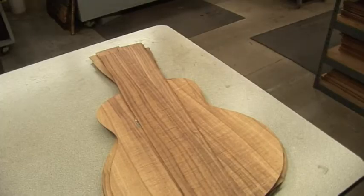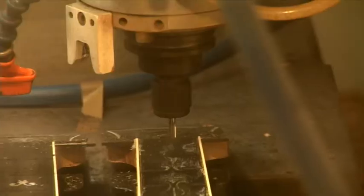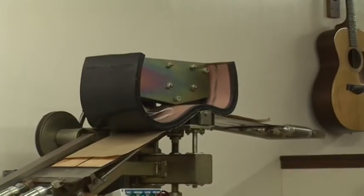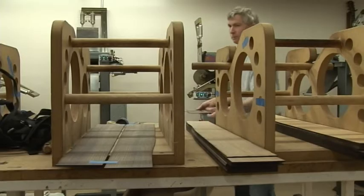The panels are cut to shape. We're using lasers to cut wood out. We're using computer-controlled machines to do intricate work. A guitar body is made of a top and a back and a set of sides. The sides are bent on benders and eventually they're put together with blocks, and they have a lining that's put on them that makes a little wider gluing area.